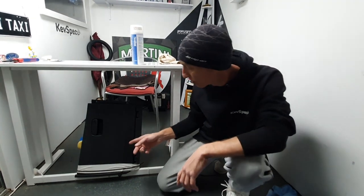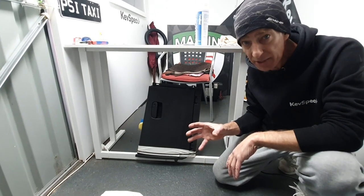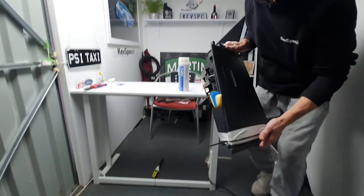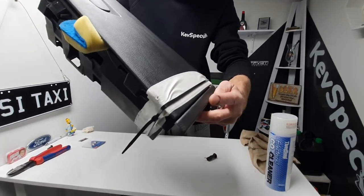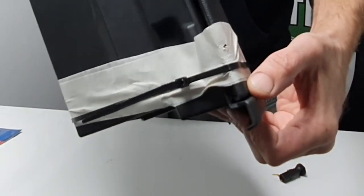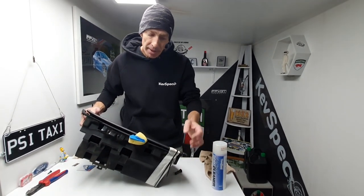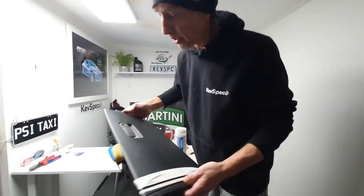I left it in front of the heater for about 40 minutes, and came back off camera to get a little more tighten out of the strap. You could use a heat gun but you've got to be really careful - heat guns are more direct and a lot hotter. The household heater gives a more general heating across a larger surface area so we're not going to warp and buckle it. Before this area here was actually flush, and with that second tighten you can see it's actually pulled in a little bit over flush, which is what I want. I'm expecting it to flex back a bit, so going over slightly means it should end up right. We'll take this outside and let it cool down - it's a nice cool day in Melbourne.